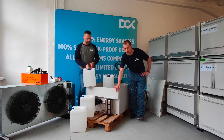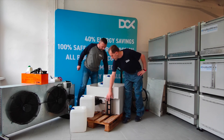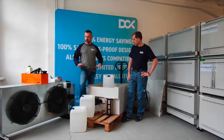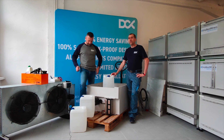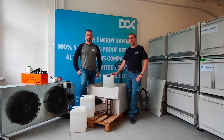Finally, the enclosure itself is equipped with a brazed plate heat exchanger and a pump which circulates the fluid inside the enclosure. These are all the components — all the goodies you need to start your mining operation, dispersing up to 40 kilowatts of heat even in a hot climate. It's about 400 kilograms on the pallet, but it's shippable by plane or sea, and we usually deliver door to door. Cheers!